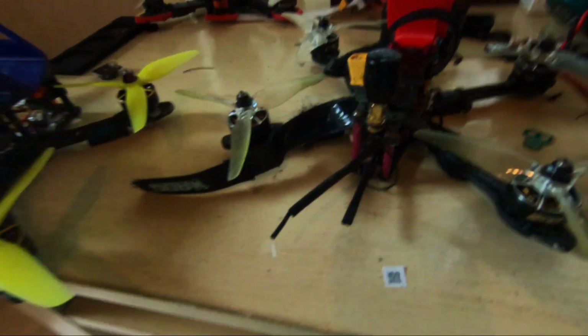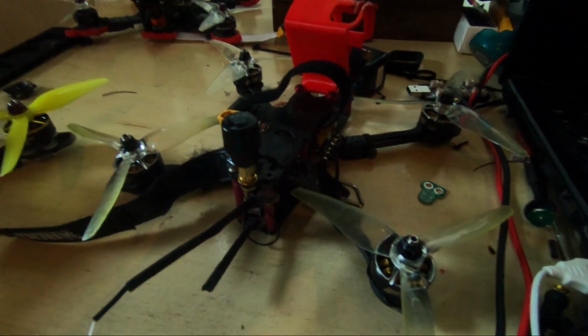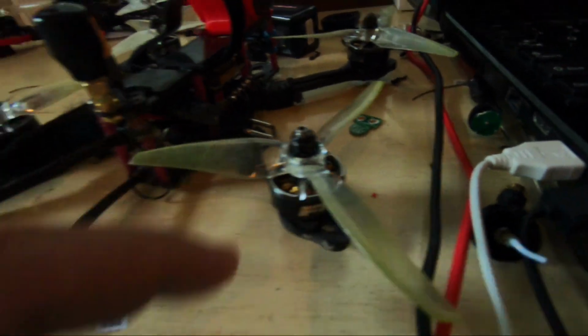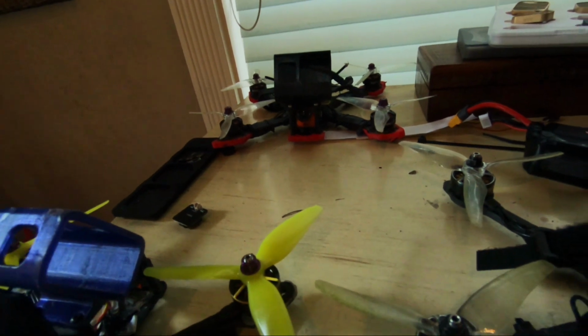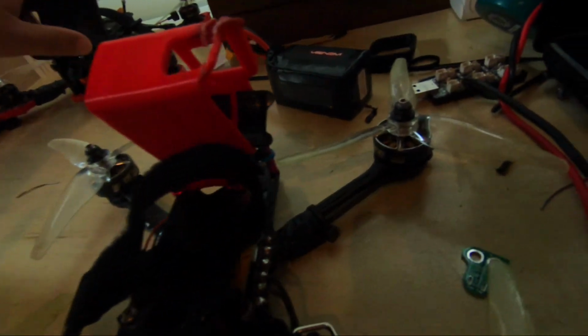With my 4.0, the way that I have it, I normally run the Pyro drone stack, but with these settings these are my three main quads. I generally run a high KV squish X frame, and then the rest can vary. I don't care too much about the components. So this one is a HolyBro stack with the ICM gyro. This one is my Pyro drone stack with the MPU 6000, and this Reverb has the Bosch gyro.